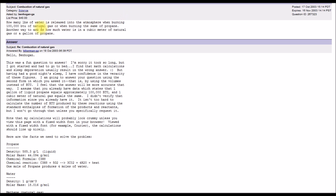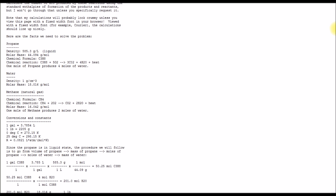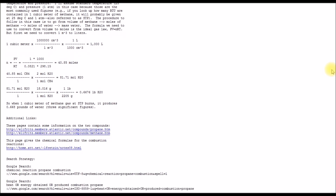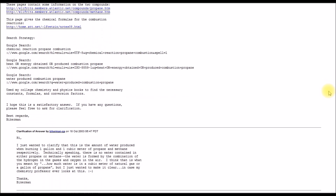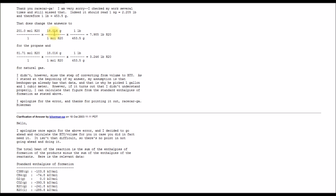One question worth answering: here on Google Answers it says how many pounds of water is released when burning 100,000 BTUs of natural gas, or one therm. This fellow went through a bunch of calculations about 14 years ago — there was a math error in the initial answer — but it comes out to about eight pounds of water per therm, or per 100,000 BTUs, or 100 cubic feet of natural gas.